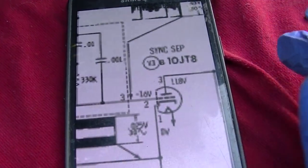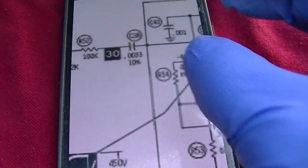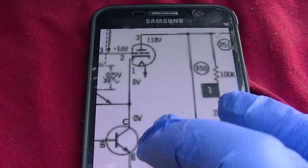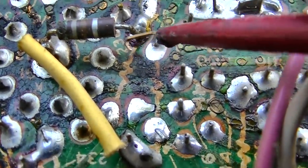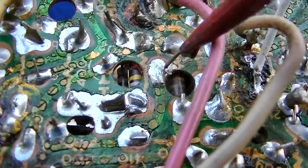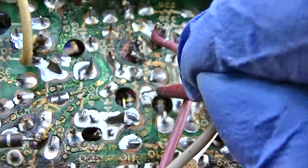Now these schematics are a little bit different, but where's that voltage come from? It comes from a 100k resistor — see it's blocked right there by a capacitor. Another problem with these circuit boards is they're very hard to follow the traces. I think I found the problem. This comes around here, connects to this resistor, then comes up here to this resistor, then comes around up here to this resistor — see it loops around right there. Well, right here we have zero volts and up here...